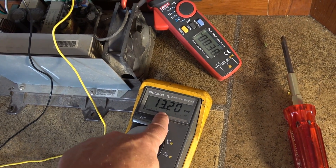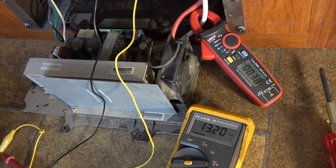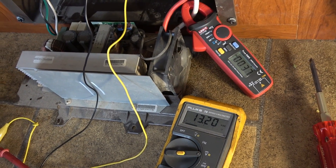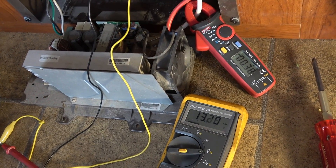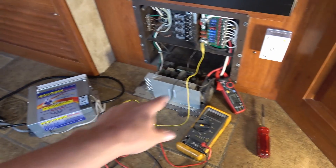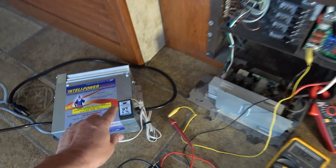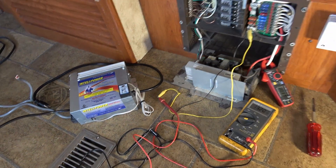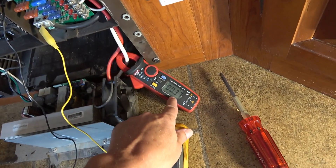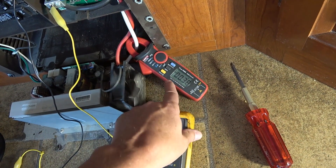13.2 volts is not enough voltage to charge the lithium battery so they just kind of stay like that — which is fine. Lithium doesn't need to be recharged to 100%, and actually they sit better at a lower capacity anyway. It's less hard on them and they last longer if you don't have them constantly sitting at full charge. Anyway, what I'm going to do is swap in the IntelliPower in place of this temporarily and see if it's capable of charging the batteries when I push the boost button. Right now we're not putting out any current at all — even though the batteries are at 59% capacity they're just sitting in trickle float mode.